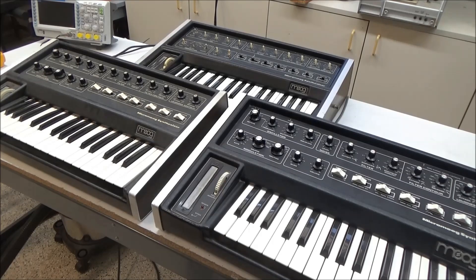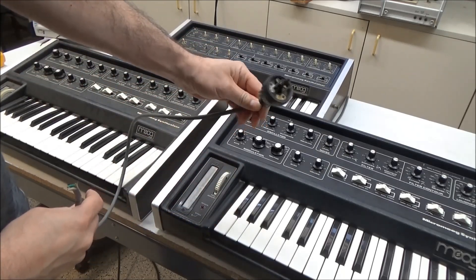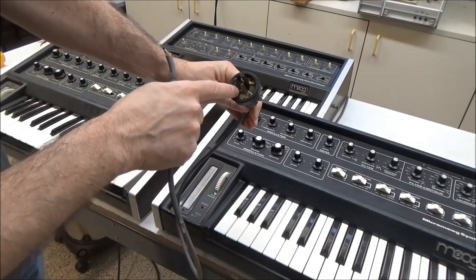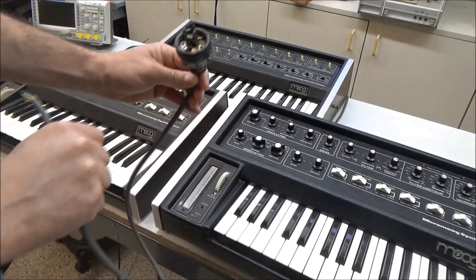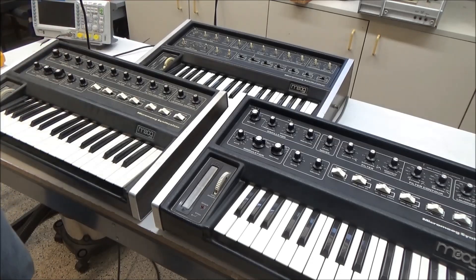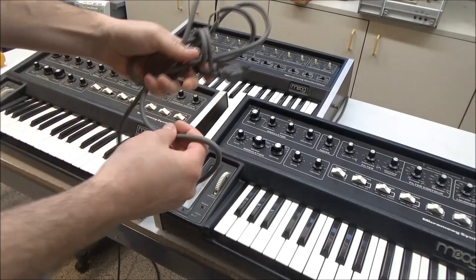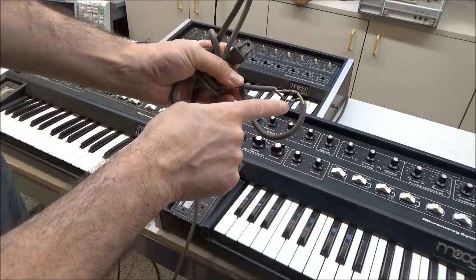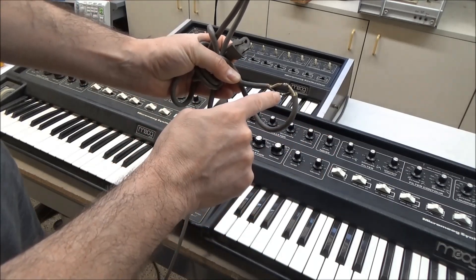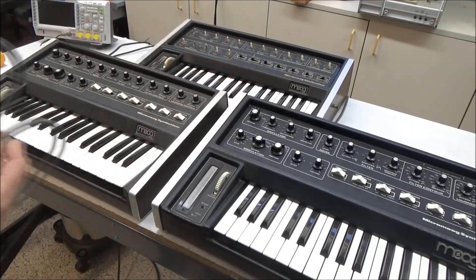I've already done some power rewiring. One of them had a very short power cord with a sus-looking plug on the end — the ground wire was disconnected. I don't really care for these open power plugs, so I replaced the power cord on that one with a nice new three-prong cord. The other one had a sufficiently long power cord but the ground plug had been pulled off. The cord had been cut and soldered with no heat shrink or anything like that, so that immediately had to go for obvious safety reasons.